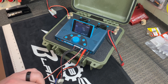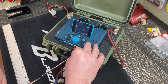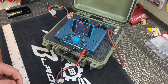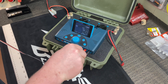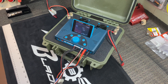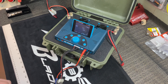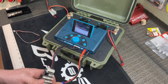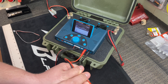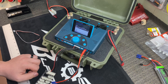So between the circuit board and this temperature sensor, something is happening. The ground trace is most likely burned from when that 4mm bullet plug fell back into the temperature port. Most people could just plug this in and be happy, but I wanted to see if I could actually fix the issue — or at least eliminate the need to plug this temperature sensor in. So we're going to disconnect this receiver battery and take the charger out of the case to investigate.